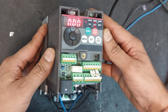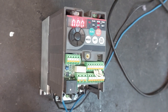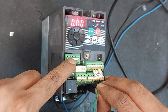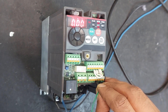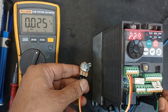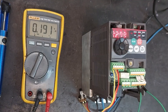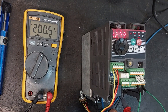We have packed it properly and it looks ready — there are no faults. Let's try giving it a run command and see what happens. After giving the run command, we can see the run signal LED has started blinking. There is no potentiometer connected yet, which is why it is showing frequency 0. Now let's connect a potentiometer. We have connected the potentiometer — giving the run command once again, we can observe that as we vary the potentiometer the frequency is also varying accordingly.